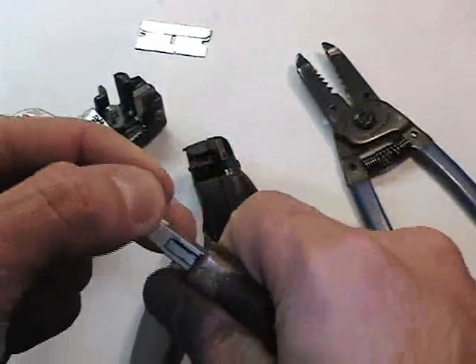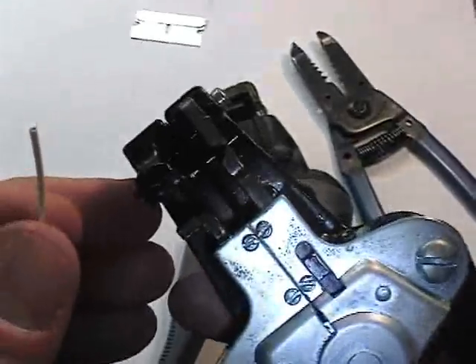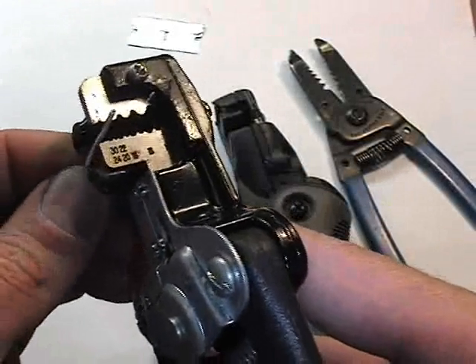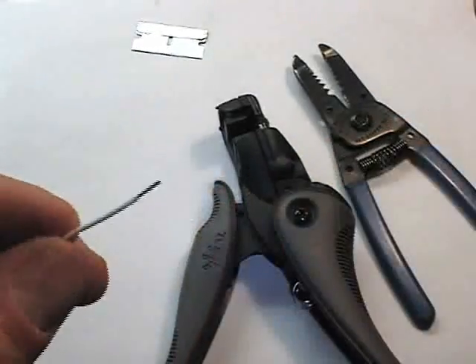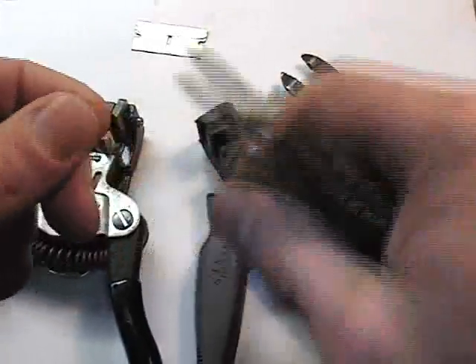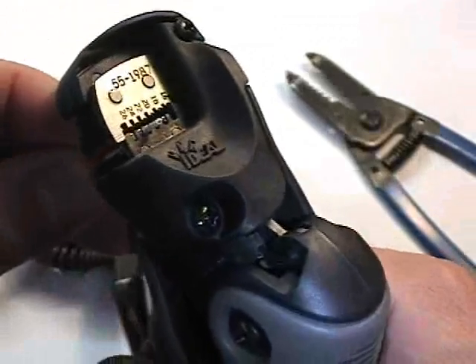We'll cut this off and demonstrate the cheaper tool. Notice the gripping jaws on this one are more of a serrated jaw, and the jaws don't line up as well — this is a cheaper tool and you get what you pay for. Same action with the tool. It looks like we have a decent wire strip. With cheaper tools like this one, you'll have to be more conscious about practicing and knowing your tool to ensure you don't get nicked strands. With a precision die tool, you can pretty much rest assured you won't have that problem.